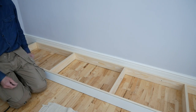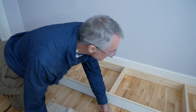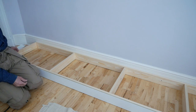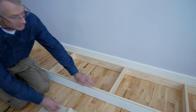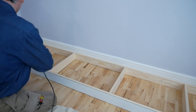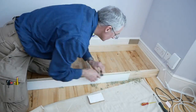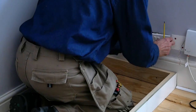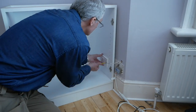The other thing I'm going to do here quickly - because this is just a pretty much straight scribe, nothing terribly complicated - is fit this now before the cabinets go in and then just plane it back. With this easy access, it's a simple job to plane the fascia to fit and fix it in place with headless pins.